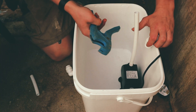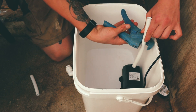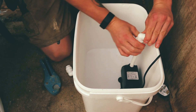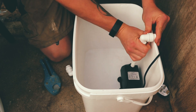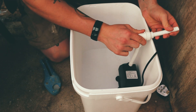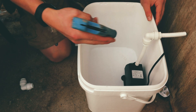Offer up your pump into your reservoir so you can cut your 15mm pipe to fit, so the elbows will direct the flow of water out the middle of the reservoir. Use small bits of 15mm pipe to connect the two elbows together to direct the flow of water to the top of the system.